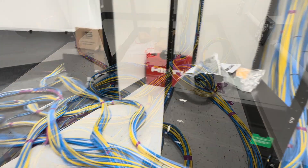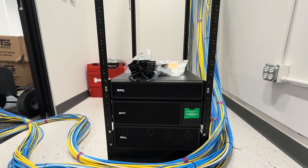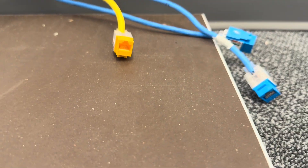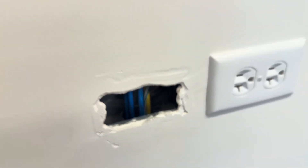After wiping out our cable spools, we've neared the end of the rough-in phase. Roughing in usually indicates that we've got all the wires where they need to be, except it's a little sloppy at each outlet. There's no labels, there's no faceplate, and they haven't been tested yet. And not all of them have been terminated.